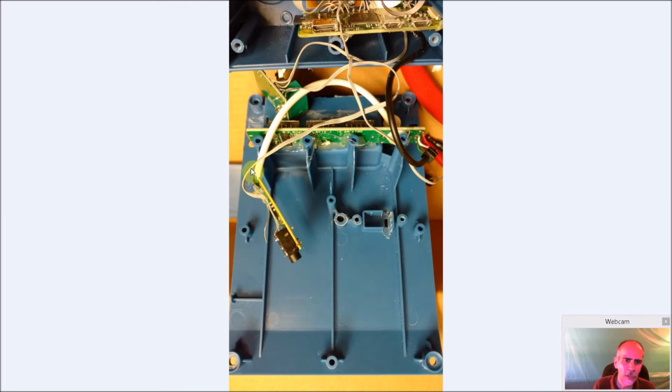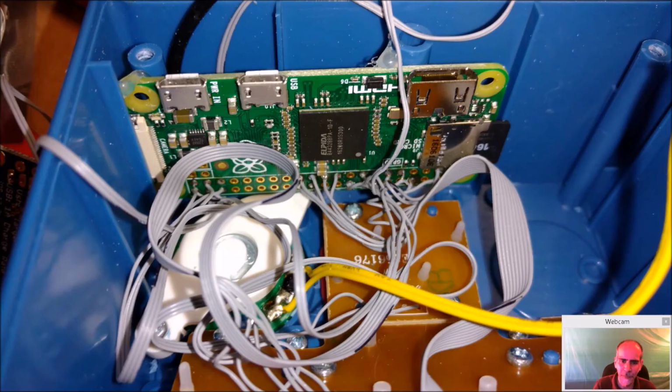And again, you're just trying to make sure when you put these in place, the Space Invaders is a bit more of a mess, actually, I think, than the Pac-Man as far as the wiring went. When you start putting all the wires together, if you don't think far enough ahead as to how you're going to route the wires, you get a bit of a spider's nest here, so it took a little time to get everything neatly packed, but eventually I did. And it looks like a real rat's nest in here, again, because I made these wires too long. If you make the wires about 5 inches versus the 10 or 8 inches I made them, there'll be less of this spaghettification mess in here.